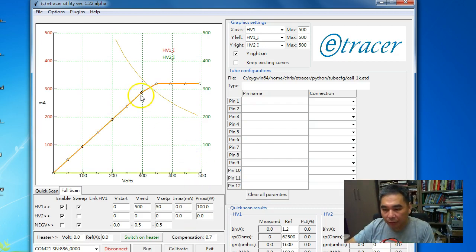Okay, as you can see, the measured current in the high voltage region is slightly lower than the expected value. This doesn't mean that this error is actually bigger, because, as I mentioned, the resistor I use as a reference is not good enough. And you can also see that all the errors add up. So there is an error in the voltage output. Even after calibration, there's error in the resistor. So all this will sum to your total error of the measurement.